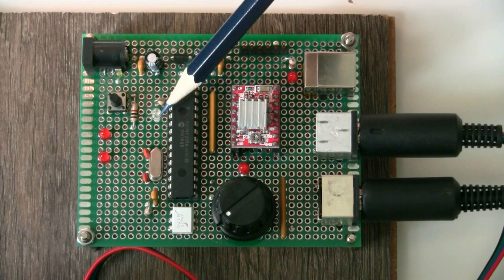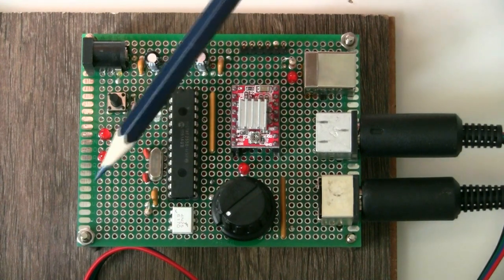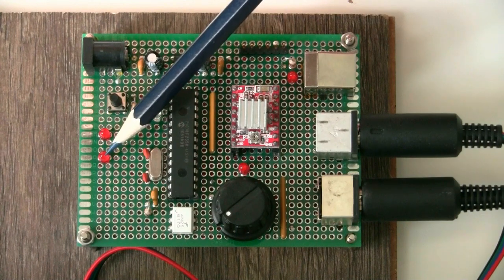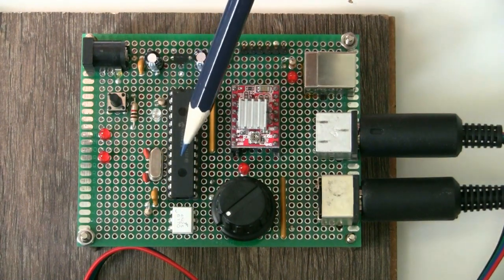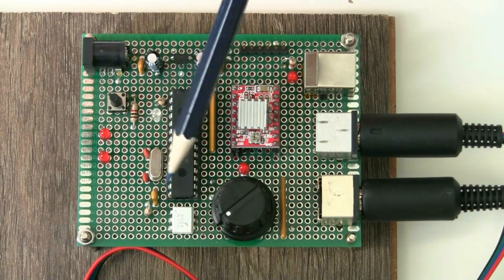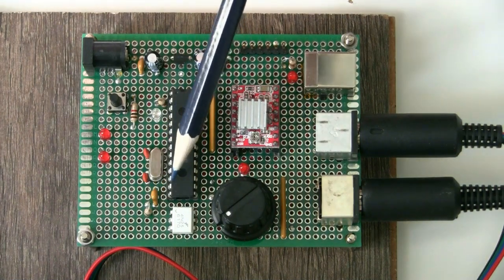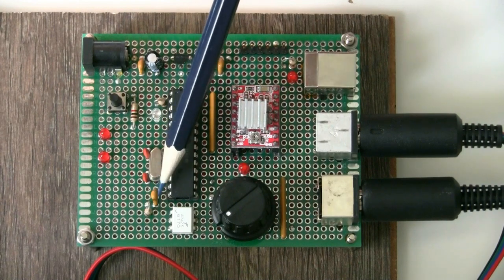There are a couple of direction LEDs: one comes on if the rail is moving towards the photographic subject, and the other if it's moving in the opposite direction. This PIC is using an internal frequency of 32MHz derived from an external 4MHz crystal and its associated tank caps. There's also a small cap here — quite important for USB — because the PIC has an onboard power supply for part of its USB functionality that requires an external cap of around 100–200nF to ground. The USB interface won't work without it.